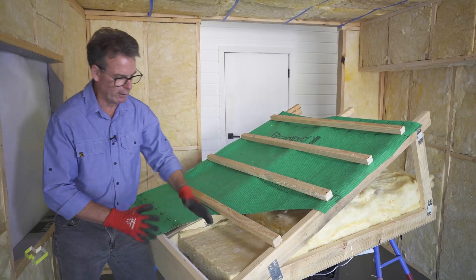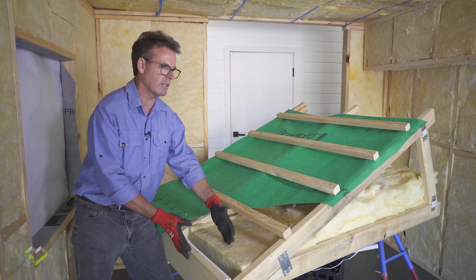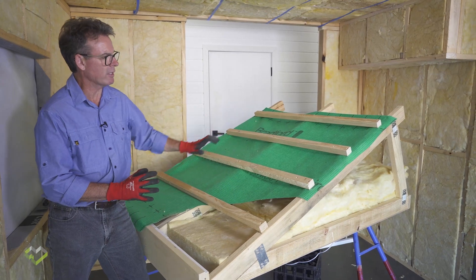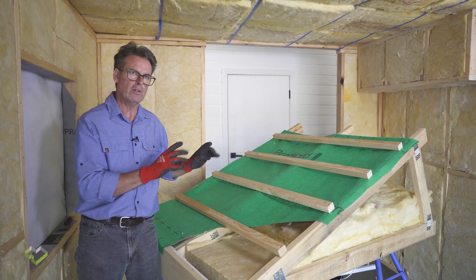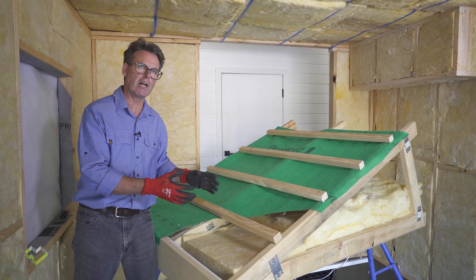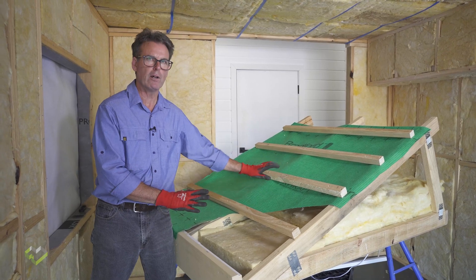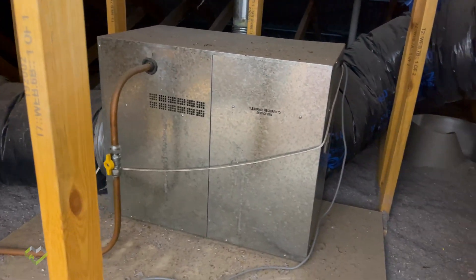Hopefully there are eaves vents and ventilation potential in the eaves themselves, and you may have a roof vent at the top. So now we get that relief air coming from the eaves and the roof cavity itself is freely ventilated. This is critical because there is a significant health issue — if you stifle airflow to a roof space, you will build up moisture, create condensation, and that may very well grow mould in your roof. The reason for the perimeter bat is to maintain the airflow, eliminate mould and any health issue associated with excessive moisture build up in the roof cavity.